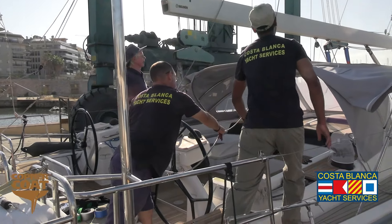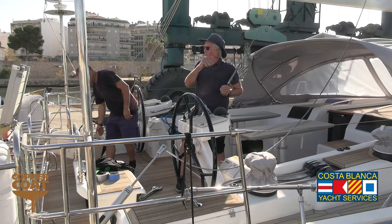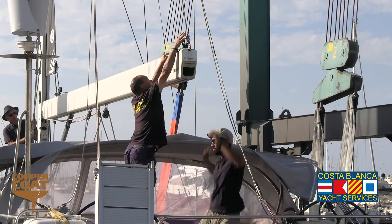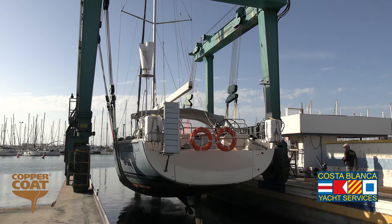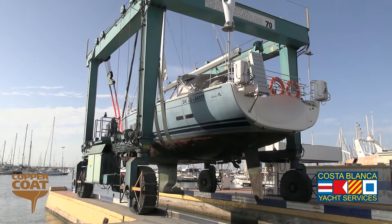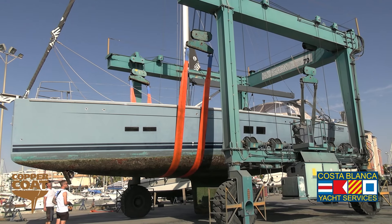As is common with larger yachts, very often the backstay has to be slackened off to enable the travel lift to lift the boat safely, which is what we did. We always make sure that the back of the mast is secured before we release the backstay, so there's no danger of damage to the boat. The boat can then be safely lifted in the travel lift without any damage to the rigging.